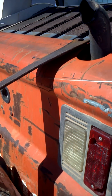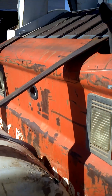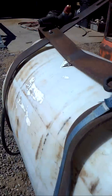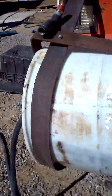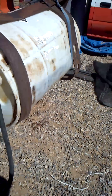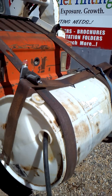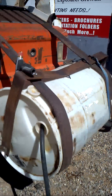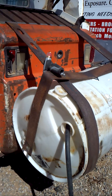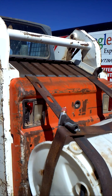All I did is hook the top so it hooks over the door, so it's easy disassembling — it's only two bolts to take it off. Then you just put the plastic barrel in, fill it up with water, and it'll give you plenty of counterweight for your Bobcat for picking up heavy items with your forks. Just another useful hint from Joe Farmer.